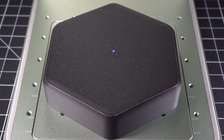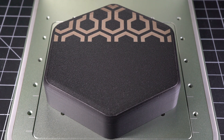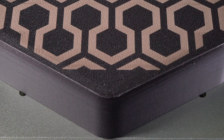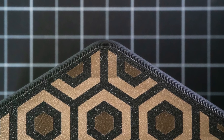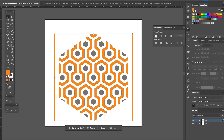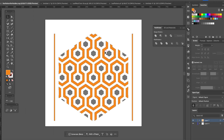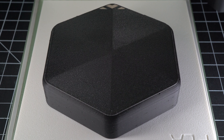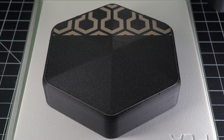If you're still having issues with overburn banding on the narrower parts of your design, there is one more thing you can try. When the laser moves from a wider portion of the design to a narrower one, it has a higher chance of more quickly heating up that smaller area. If you add a thin bar on either side of your design that are equal in height to your design, it will effectively force the galvo mirror to rotate the same amount, making those raster lines equal in width as it progresses down the design.